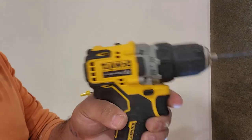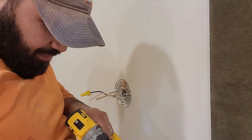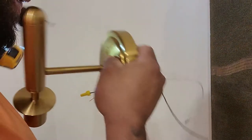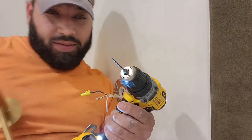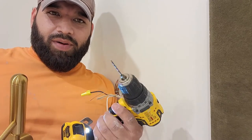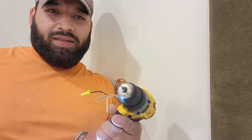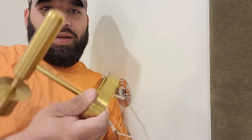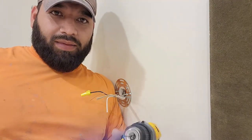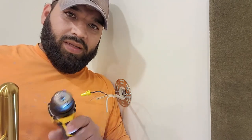This switch connects it on and disconnects it off — basically what every switch in a house does. All a switch does is break the black hot wire. Time to drill — I'm going to drill a little pilot hole first using a small drill bit. I'm using a 12-volt drill, doing this on the carpet. One thing I've learned from drilling metal: go slow, because it makes a cleaner cut and it doesn't burn your bits. If you go super fast, you're going to burn your bit, not start it right, and probably mess it up.